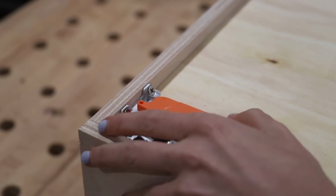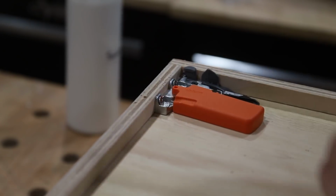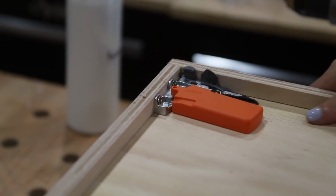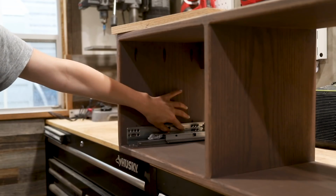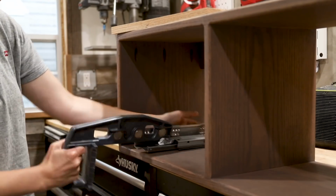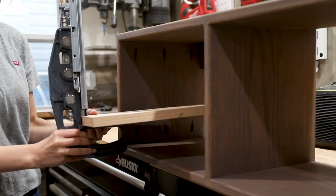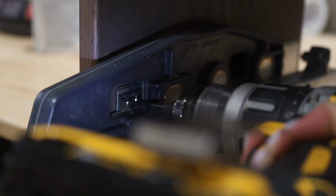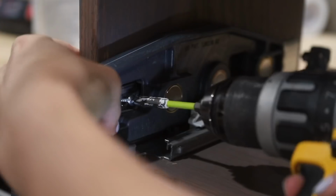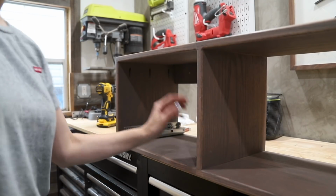The other thing that's really cool about this whole jig kit is that it does come with a jig for the drawer slides themselves, which bumps up to the build that you're working on so that you're able to align the drawer slides exactly where they need to go on the drawer box, but also inside the cabinet as well. I was also able to use the drawer front that I was using for this build to measure exactly where this jig needed to go, and then all of the spacing was absolutely perfect for when I had to pop that drawer in later. Okay, moment of truth.